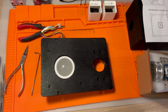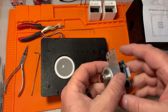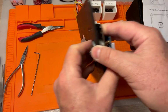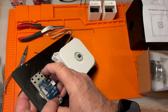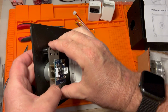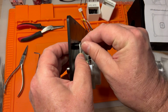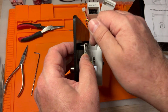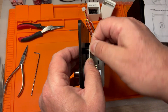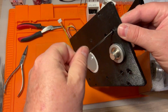Guess what? The spinner, much easier. Everything here is just nicely set up, nothing really difficult to get to. It's just 4 standoffs, and then these things come through on the other side. So let's do the first of these standoffs. We'll be continuing to use the fantastic M3 20 millimeter screws. I'll tighten that right now.